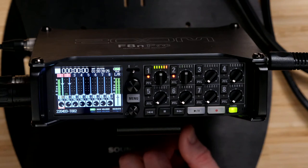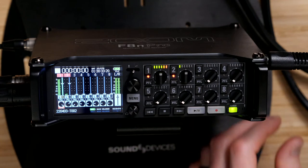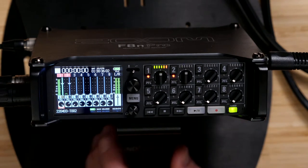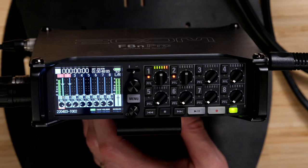They are still dB full scale, the traditional meters we would typically see on a 16 or 24 bit recorder. And so you don't get any sort of indication. In addition to that, it doesn't have any way to know that a microphone necessarily has saturated, has reached its max SPL either. Could something be developed to do that? I imagine. That'd be tricky business, though. I don't know. It's a good question. But I would say right now the answer is no, based on what I've seen.